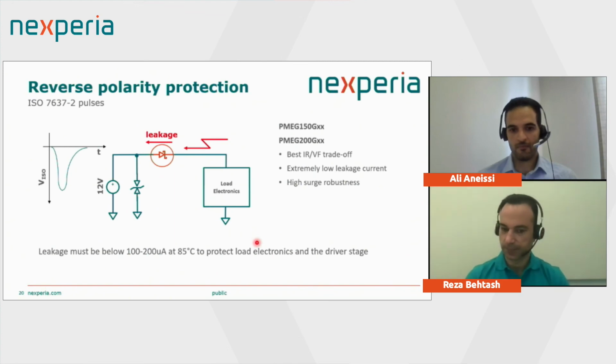The next one is also about automotive qualification. What does it mean, 2 times AEC-Q101? That means you are testing twice the time you would usually test. For example, there are requirements regarding temperature cycling. The device has to withstand a number of temperature cycles, and I think the standard AEC-Q is 1,000 cycles. We go for 2,000. And the same also, for example, for high temperature reverse bias tests. You have to qualify the product for a given time in reverse bias. We go beyond that time. So it is really twice the time. This is the meaning of that.